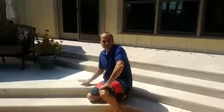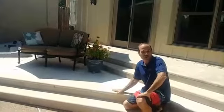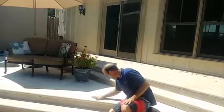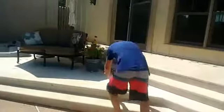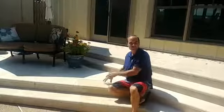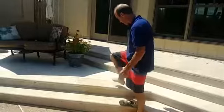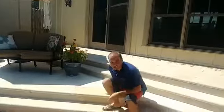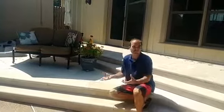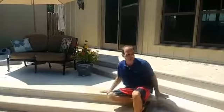we're going to look at this area here, which is a different material. This is all travertine. Travertine's an interesting product, and it's really good for this because it's porous, for one. If you have wet feet and you put wet on there, in fact, I'm going to get a little bit of water. So watch this. It kind of just soaks right in. So it still gives you grip because this is a porous material. If your foot's on there, you actually have a little bit of grip. Now, if you get a big puddle to where this absorbs the water, and you put more water on top of it, it can still be slick like anything, but the first initial water that's coming off your feet gives you a little bit of grip, so that's nice.